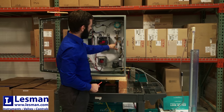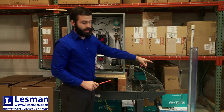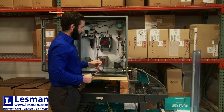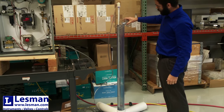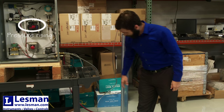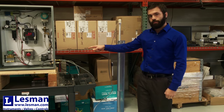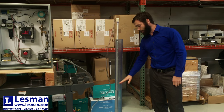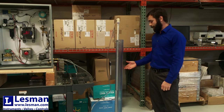Out of this, it goes straight out to a T where the transmitter is measuring the pressure, and then it's going out into the actual tank. As the level increases, the head pressure on the bottom of your dip tube is going to start going higher, and it's going to require more pressure to keep that constant flow rate. Based on that, pressure is the only thing changing — as the level gets higher, your pressure has to go up; as the level gets lower, your pressure has to go down to keep that same flow rate, and that way you can infer the level.